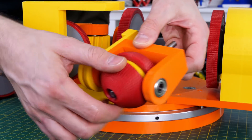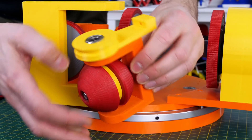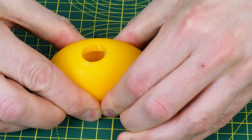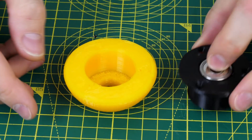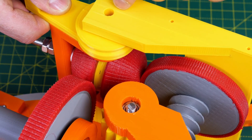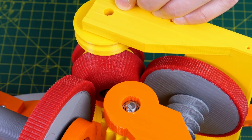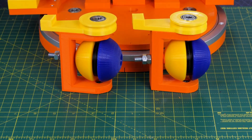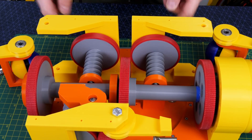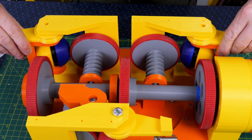Now we need to link the two red wheels with the ball clutch. This is basically a ball that rotates in one axis and it has another axis which is vertical and perpendicular to the first axis so it can rotate where it needs to. These are two TPU hemispheres - basically the same as last time - with a rigid core with a bearing fitted, and two of those fit face to face to make up the whole ball. That vertical rotation is on two bearings above and below and it will rotate at around 60 degrees in each direction so we can drive between the two wheels. I've taken the two previous balls from the previous CVT robot, and those balls fit in on another vertical axis on each end to link the two drive wheels with the two worm gears.